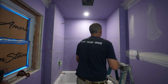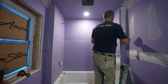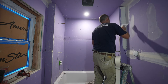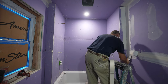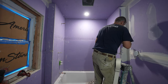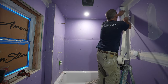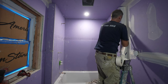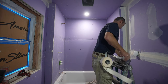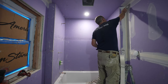I'll be having tile work coming up along here, but I still want to mud this corner because even though it's going to be tiled over, I might have a little bit of extra space and I want to make sure this corner looks good. I'm not worried about where the tile meets tile. I just want to do the upper corners. I have a feeling my tile work is going to need a little bit of volume here in the corner, and you might see into it, so I'm going to tape it and ensure that it's finished.